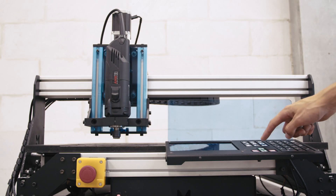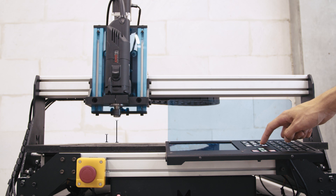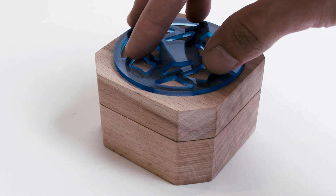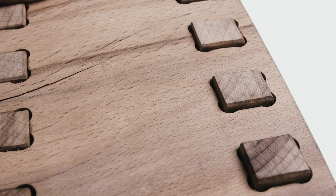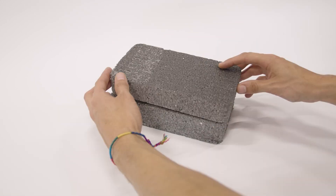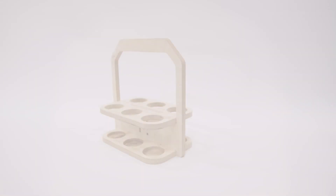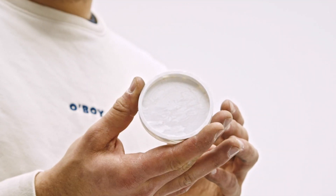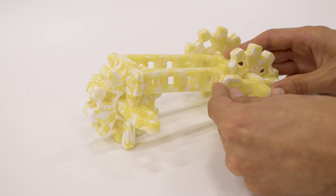All sizes have a 110mm Z travel distance, allowing you to mill through 50mm thick stock without any problem. With properly tweaked milling operations, a 0.2mm precision is achievable in soft materials such as wood and plastics. The engineering of this machine allows it to produce a medium-sized foam project in about 4–10 minutes, complex wooden parts in only 5 minutes, and design elements out of plastic in under 2 minutes.